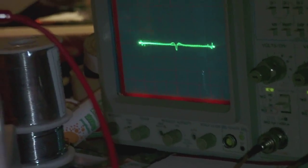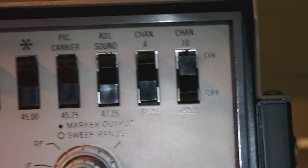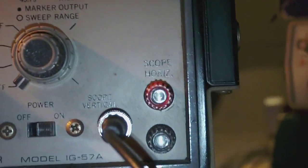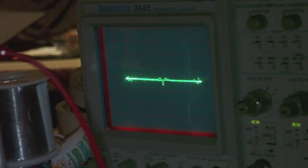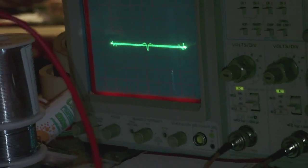Now, like I said, this is only a simulation, okay? Because like I said before, I just can't get the right frequency I would need to do the job. The highest frequency I can generate is 139 megahertz and a quarter, and not 195. That's the first problem. Secondly, this is just a superimposed high frequency signal, and I don't know whether I could call that a proper marker. So anyway, I'm really not happy with the setup as it is right now.